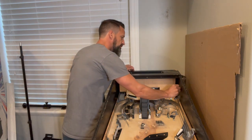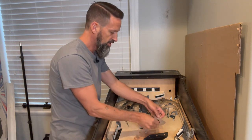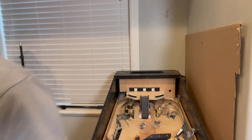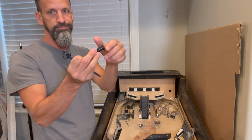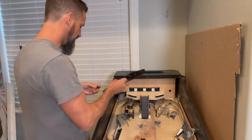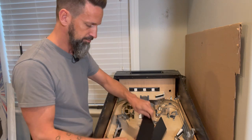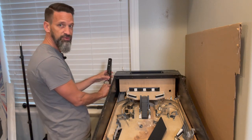If you're borrowing a donor cabinet, these holes are already drilled in the right spot. You've got two carriage bolts with square ends that lock into these, and you use a big Allen key — size six — to tighten those down. One goes inside the other with the bracket in between. The flange on the hinge is going to be pointing away from the cabinet so you can fold it up and down cleanly.